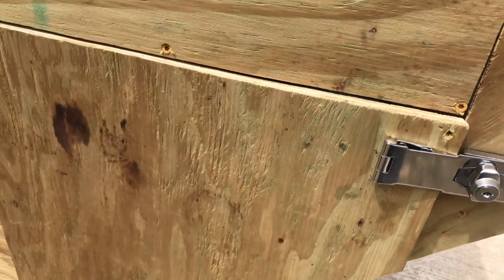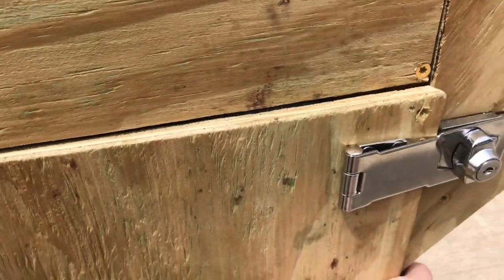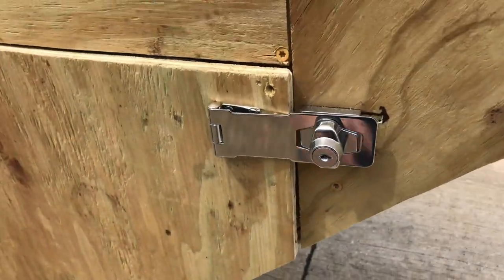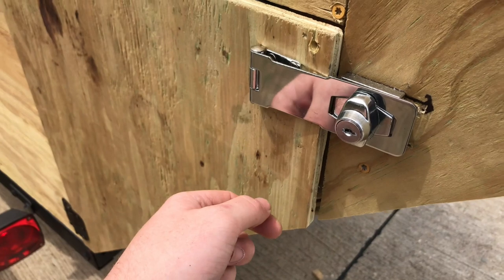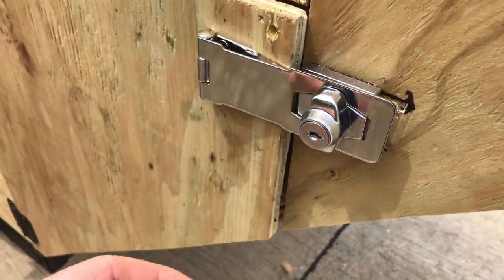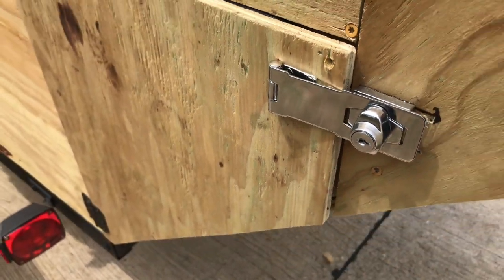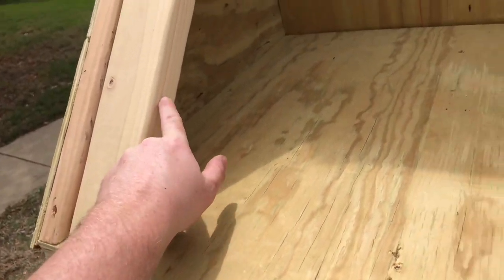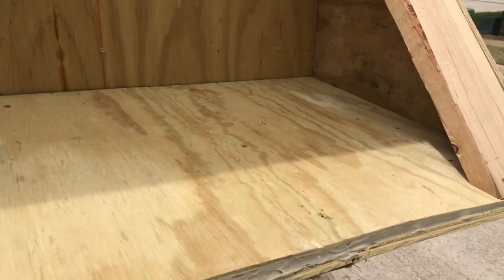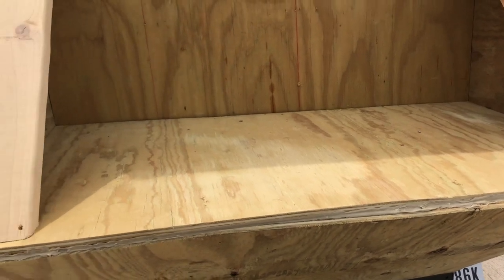I'm going to go ahead and make a run to the hardware store. I'm going to get a through bolt because the wood was a little warped and it is sticking out a bit. I'm going to get a through bolt that will flip up, go back, flip down — one of those just to keep it pushed up against the weather stripping so it's a watertight seal. I'm also going to pick up those little triangle pieces I was talking about in the last video, some more weather stripping, and maybe a few other things. Then I'll be on my way back to get the hatch finished up and we're done with the kitchen and ready for paint.